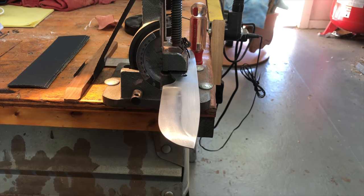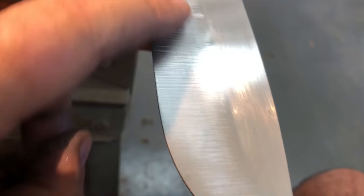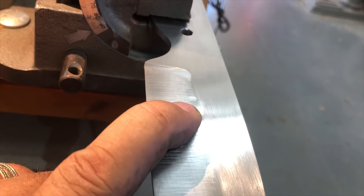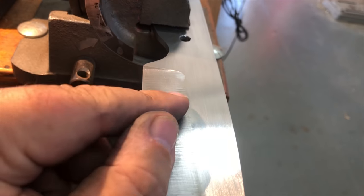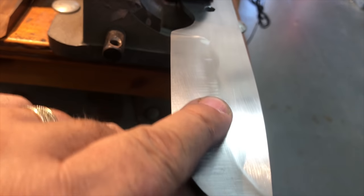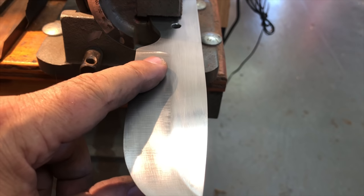Anyway, I'm finally out here. I've got a cut out, I've got the basic bevel cut. Now I've got to sand out all the grinding marks. And I have a divot there — I'll have to sand out that little divot right there. That divot is from hesitating on the belt. If I had seen it while I was on the belt, I'd have tried to rub it out. That's going to take a whole lot of hand sanding. I'm not good enough on the belt grinder — if I were to put this back on a belt grinder, I'd make it worse.